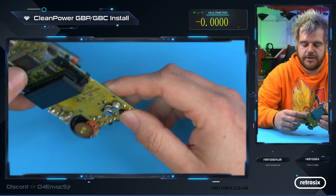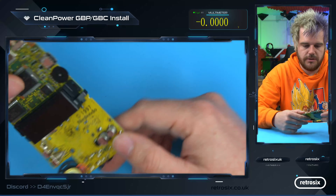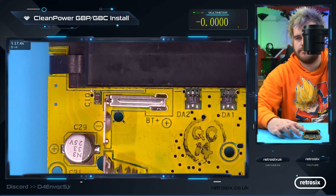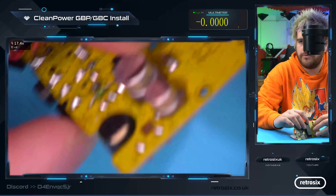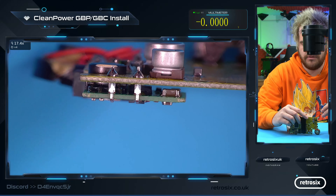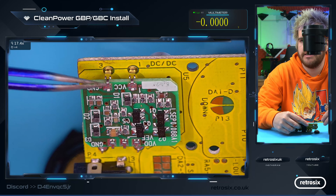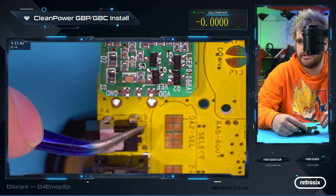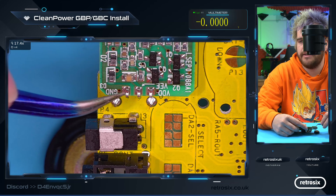Let me show you how the original regulator works, what voltages to expect, and what things are doing. Looking under the scope, you can see the pins of the voltage regulator, which are basically just poking through from the green board. The green board has power labeled VCC and ground that come down into the main board. The other side is labeled VDD, which is the output. This is the LCD voltage labeled VEE, and then ground.